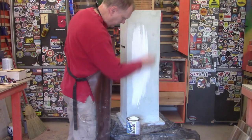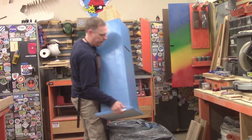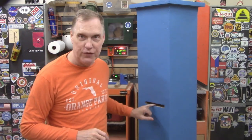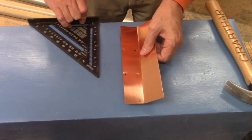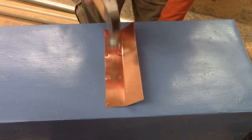Time to paint! Going to use some exterior paint tinted to this color. This bat house is going to live outside, so it's cedar, topped with bondo, topped with primer, topped with three coats of outdoor paint. If that doesn't keep the alligators away from our bats, nothing will. The next day, everything's dry — now it's time for the final touch. This vent on the side is here to let the bats breathe a little bit, but we live in a swamp so rain is a problem. Sideways hurricane winds might be a problem, so I'm going to put some copper foil down to make a little awning to keep it dry inside. The bat house is complete.